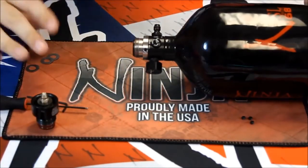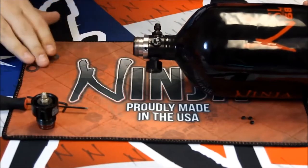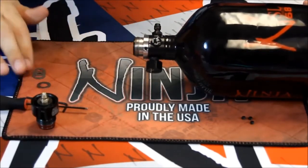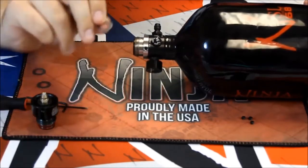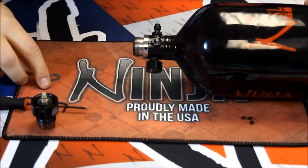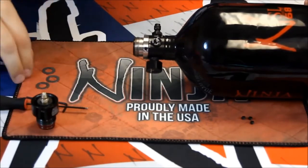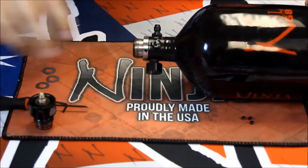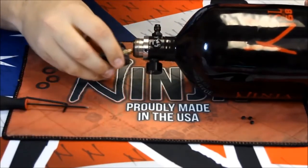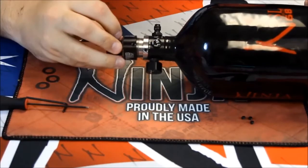For the sake of this video, we're going to keep this at 450, so I'm not going to put any of these shims back in there, so we can leave those to the side. Make sure you don't lose these guys. They're very small, very thin, very easy to lose. If you do lose them, contact us. We can get you some replacements, but please try and make sure you don't lose those. So we're going to keep it at 450 PSI. We don't need to put any shims in there. We're good to go. Just place that right back on.